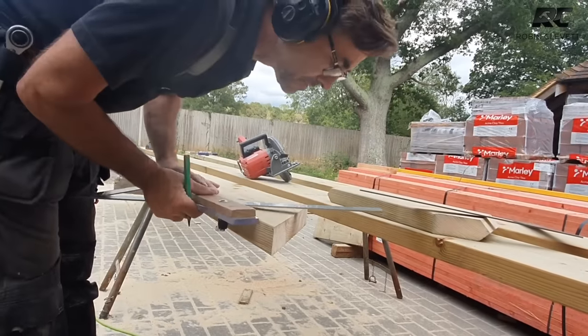My bird's mouth over the ashlar rises exactly 1,742mm. We're dropping 1,742mm and traveling along — I'll plumb this down as well with a level. I'm stepping off with my square: I'm 1,742 millimeters from plate to plate — that's the rise of the wall plates.